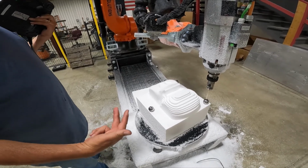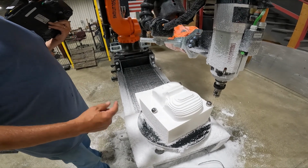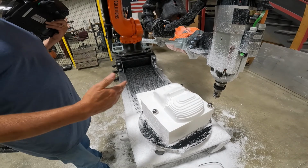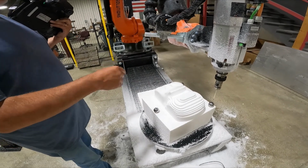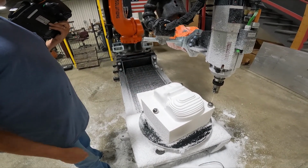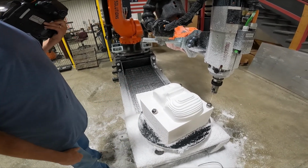Now, when this is finished, the most important step of all is you need to run the program one more time, because that gives you the ability to redo number three if you need to, or to commit the values that you just probed for everything, to commit those to memory. If you don't commit them to memory, you might as well not have started in the first place.